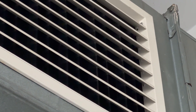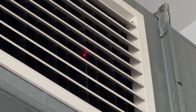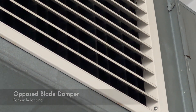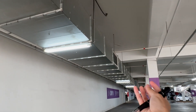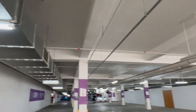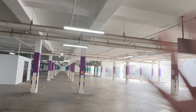Inside this kind of grill, there's a damper — also called a multi-blade damper — which we can adjust. We need to make adjustments so that airflow is balanced across all the grilles in the space, ensuring the front ones don't suck more than the ones at the back. We want everything balanced so that if there's smoke anywhere in the area, the whole system can extract it effectively.